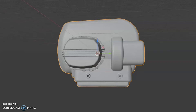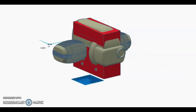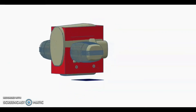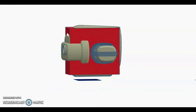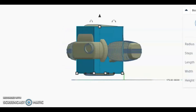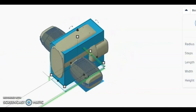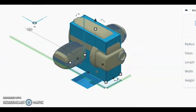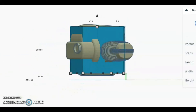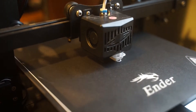I'm just going to pull in a cube here of the right dimension and see how close we are — we're pretty far off. Luckily we do have a bit of wiggle room. It may look pretty terrible at the moment but I think we've got about a centimeter either side. We need to bring it out by a couple of centimeters on the top corner. We actually have six centimeters of tolerance — if we widen this by six centimeters it will still fit within the frame — and I think I've got four centimeters front to back as well. So I'll go away and do that now and we will start with the 3D printing.